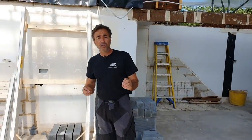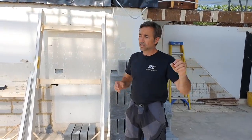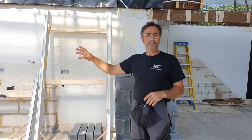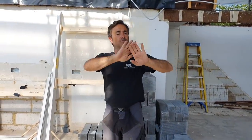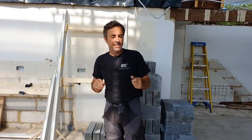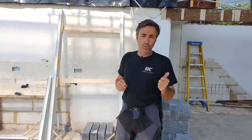So what have we got? We've got our bricks, our blocks, some concrete blocks. One end of the building is face brickwork with three windows, and the other part of the building is rendered to match the existing — that's got concrete blocks on the outside skin and a thermal light block on the inside skin.